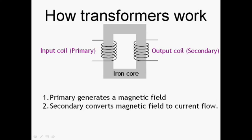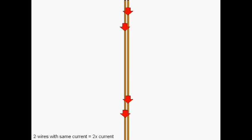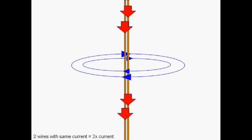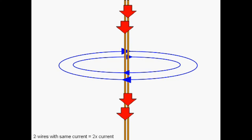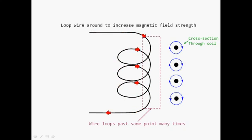When we pass a current through a wire, a magnetic field is formed. To get a stronger magnetic field, we get more current to flow through the wire. Alternatively, we can use two wires — doubling the wires effectively doubles the current flow past a certain point, and therefore doubles the magnetic field strength. We can use this principle of multiple wires to greatly increase the strength of an electromagnet. By looping a wire into a coil, the same current-carrying conductor passes the same point repeatedly, and the magnetic field from each wire effectively adds together, making for a very strong magnet.